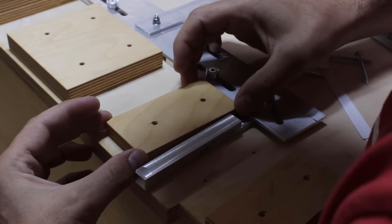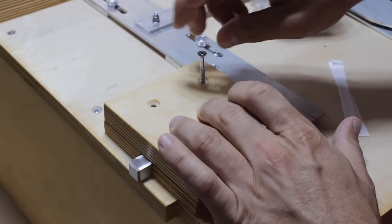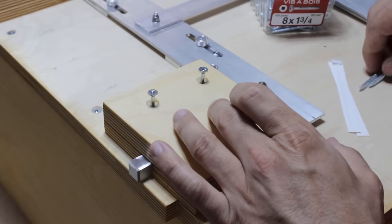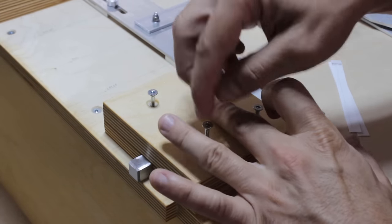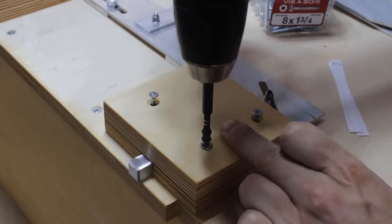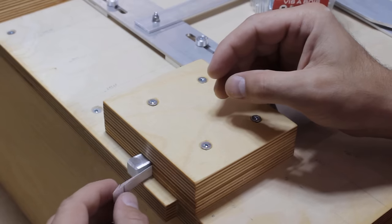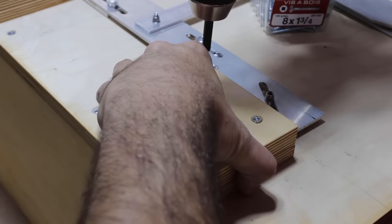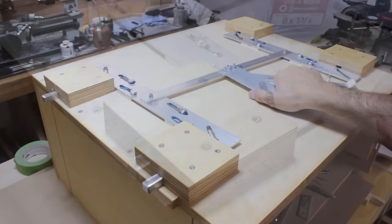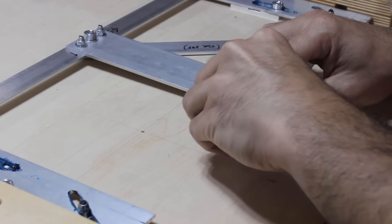After this, I need to install the locking pin guide blocks. They're all made of plywood and I will just stack them onto each other and adjust the play from the pin from side to side by using some paper shims. I greased everything up and made a few minor adjustments to make the mechanism move smoothly. And then I can start to install the secondary spring lever.